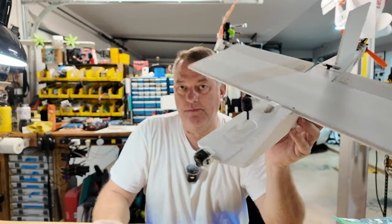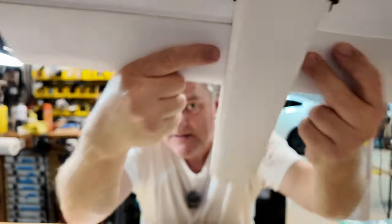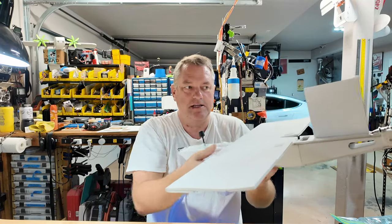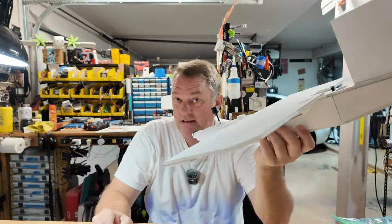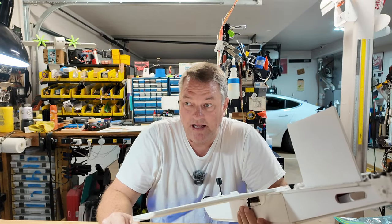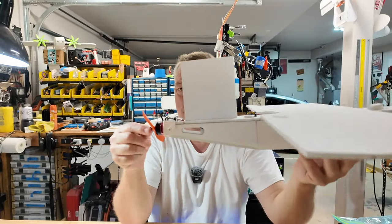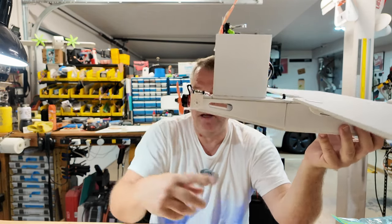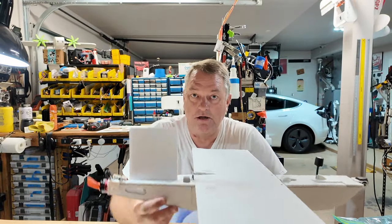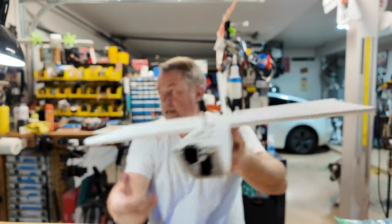Now we've got a live camera in there — just hook up a little cable at the back. Two servos, real simple. Center gravity marks are visible there, so the airplane balances right on those marks when it has a battery. Elevator position to take off is nose up. This is a plank, so it has all plank tendencies — you'll have a lot less pitching moment from the elevons versus an organic tail surface. Critical to any plank design: you have a couple of degrees of incidence put into the motor mount so the thrust line meets the center of the aerodynamic chord of the wing, which prevents pitch-power coupling. This airplane doesn't have elegant lines or a swoopy tail, but it's really easy to make and it flies well.